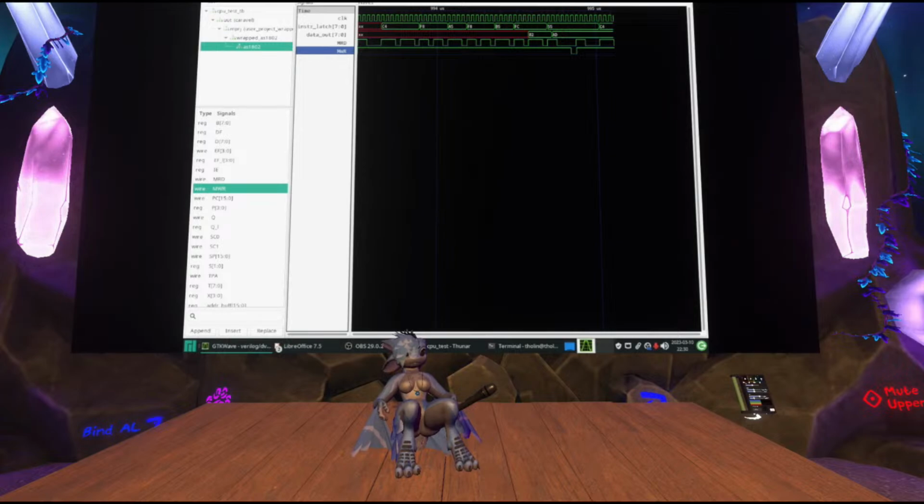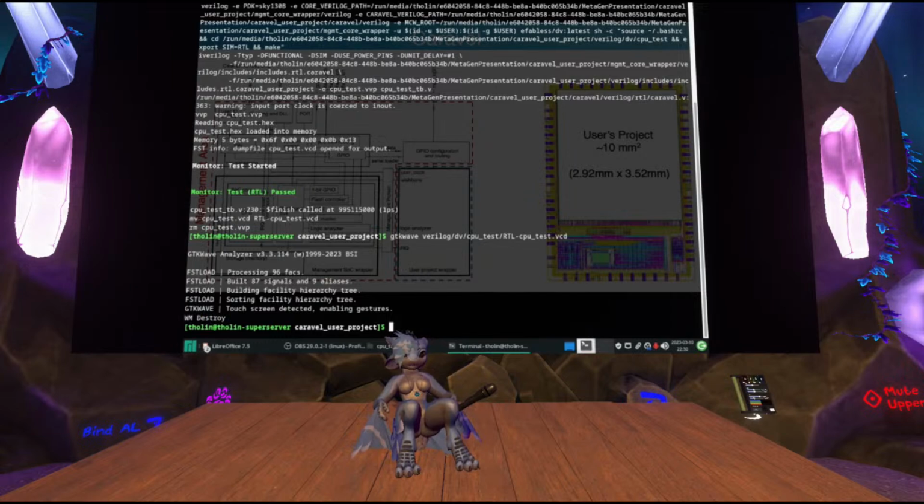Although that's not quite running an actual simulation of the chip. This is an RTL simulation, which means I'm basically executing the source Verilog as if it was code. I can actually run something called a gate-level simulation. This will actually simulate the chip. It will take the output of the last build with OpenLane, and it will simulate every single standard cell. It's almost down to individual transistors.